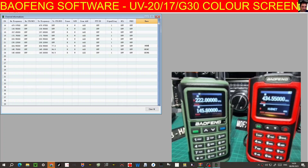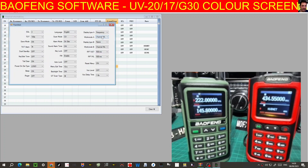It doesn't have to show the name — you can choose that. By the way, this works great on DTMF, just hold the PTT and type. Go to Function, and then if you want to show the channel memory or the frequency — I do one on the B band as channel, and on the A band I put frequency, just so I get the best of both worlds. So channel mode: B is name, and A is frequency — that's how I do it. You can actually load up a photograph on this device.